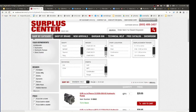Yeah, gallons per minute. It has to do with how quick the shaft is moving. Now you've got a hydraulic motor, and you look at, okay, what is its rated gallons per minute? Because you want to drive that motor. And if you got four of them, you need four times that. Yep. So there you go.